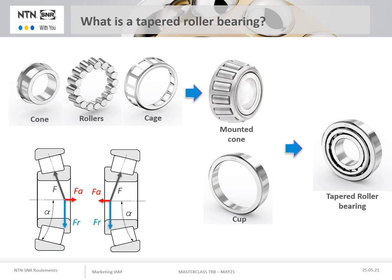The downside of this contact angle is that these bearings have to be mounted in pairs, as any purely radial load will result in an axial reaction, so a second bearing is needed to take the axial loads. The setup of the operating axial clearance is done through this pair of bearings.